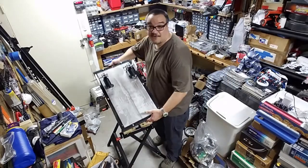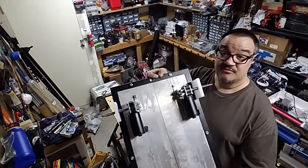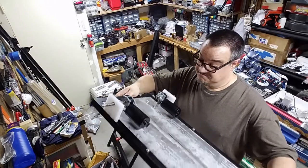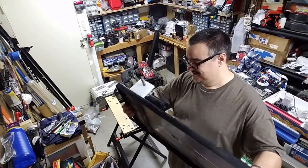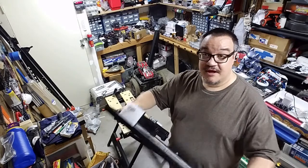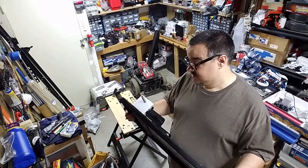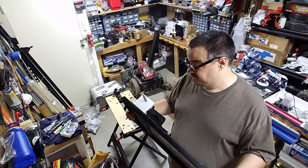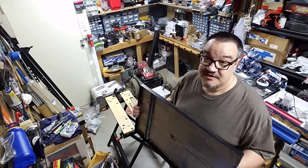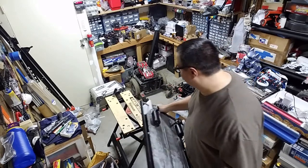All right — motors are mounted and everything's in place. Didn't take too long. These bearing blocks — the nice thing about HDPE is it's self-lubricating, so they're kind of like bearings you don't really have to take much care of. They'll wear eventually, but cutting board is cheap.